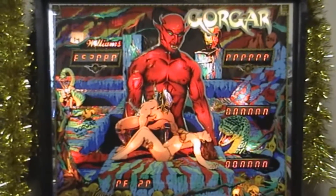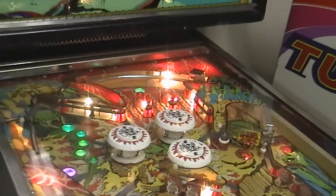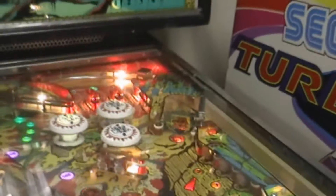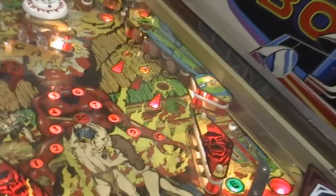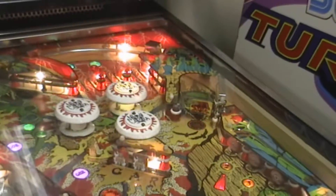This was the first talking pinball machine. Just real quick, show you the machine - nice glare there. I haven't really done anything to it other than get it running. We got the machine for $450 and it really wasn't running at all. The lights were out because somebody had converted all the general illumination from AC to DC, and the rectifier they had put in to do that had gone out, so we fixed that.